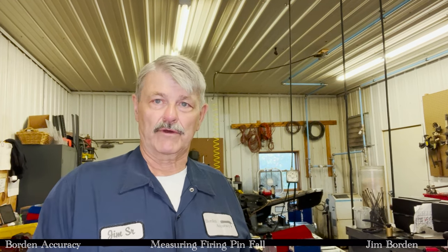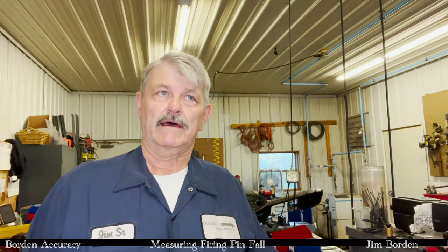Something I've taken for granted for a long time. I get customers who have trigger frames installed backwards — the old style trigger frames — which robbed them of a lot of firing pin fall and caused failed-to-fire issues. After doing much problem solving, I found it's easier to have a customer directly measure their firing pin fall, tell me that number, and then I can tell them whether or not they have their trigger set up improperly.